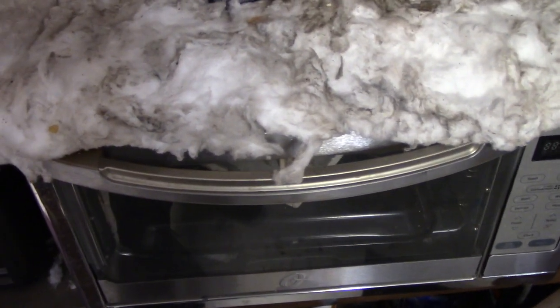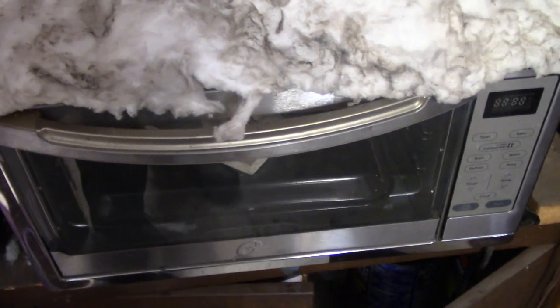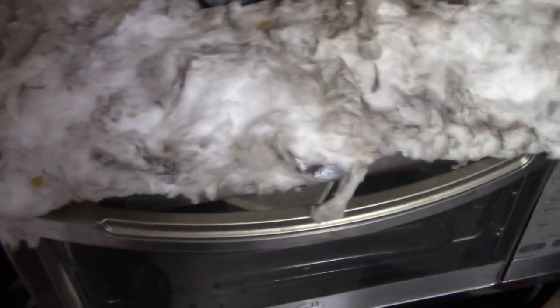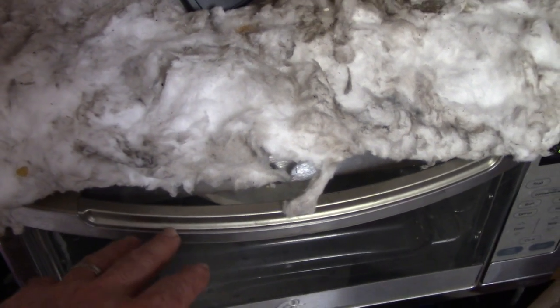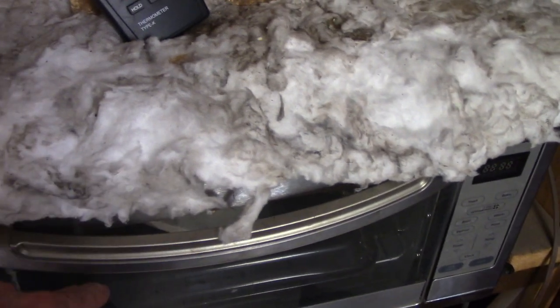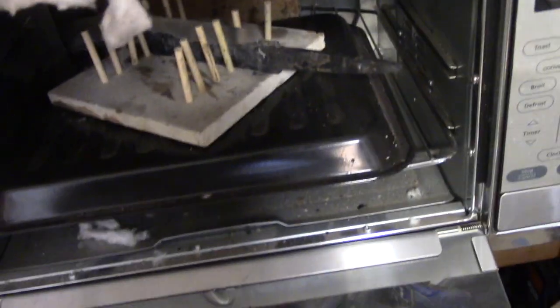One thing I will remind you: I'm going to go ahead and temper this, and I'll save you the trouble of watching that. You definitely want to make sure that, just like I do with my heat treating oven, when I'm tempering, I make sure that my oven is up to temp before I put the blade in there. Now, I know I put it in here just to show you, but I'm not going to have the blade in there while this is coming up to temp.